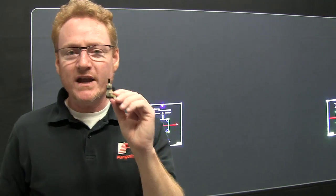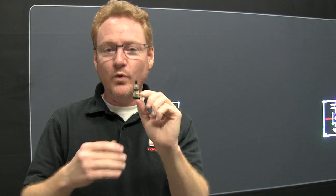So when the news came out that we came up with this new little Compact 506 scanner, and we're calling this a 30K scanner, there were other people up on the forums saying, well, what about 40K? And I heard these things called DT40s, what's that? Well, as far as we know, DT40 is really just the model number, not really the K of the scanner. What makes a scanner a 30K scanner has to do with the torque to inertia ratio of the rotor and also the heat loading of the coil. That's really what makes a scanner go a particular K. We've designed our scanner to go 30K, and we call it Compact 506. That doesn't mean it goes 506K. But anyway, to settle the bet, there's been a lot of discussion up there in the forum of, oh, 30K, 40K, and I don't want to give up my extra 10K.